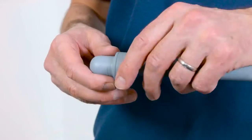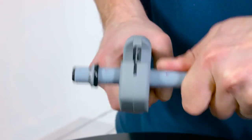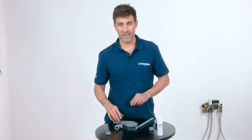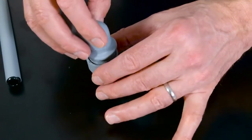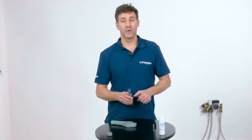Here's how simple demounting and replacing the fittings can be. Step 1: Unscrew the cap nut. Step 2: Remove and cut the pipe end with the components attached and discard. Step 3: Insert the new cap nut and components into the fitting and hand tighten. Re-lubricate if necessary using Polypipe silicone lubricant. Then continue with pipe jointing.